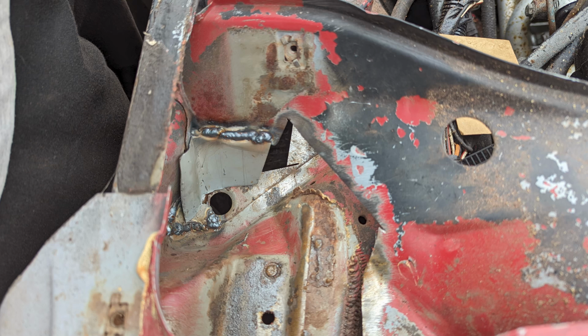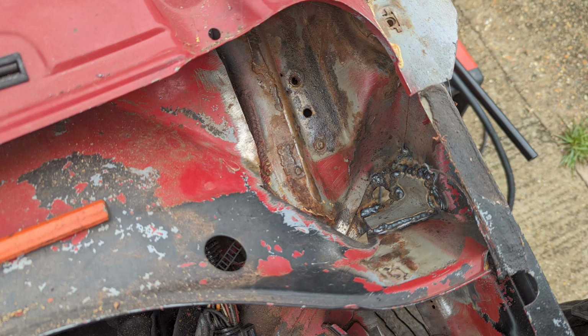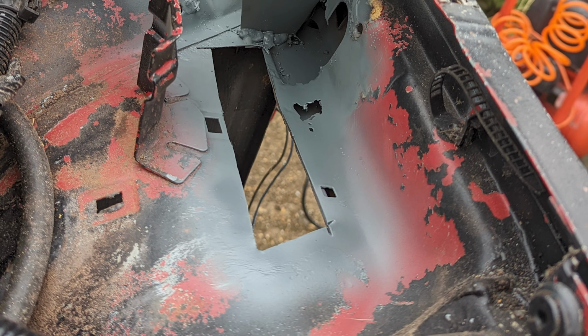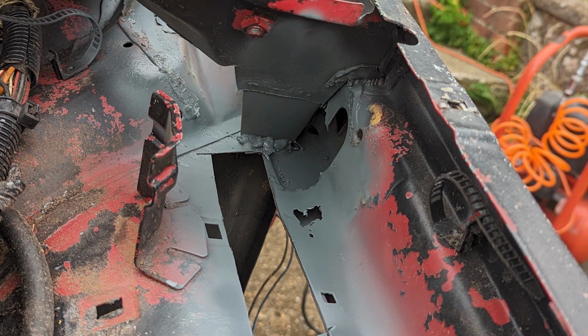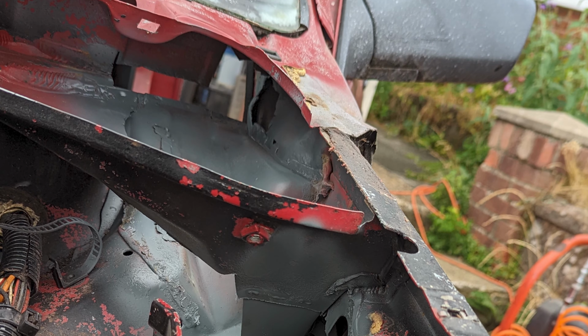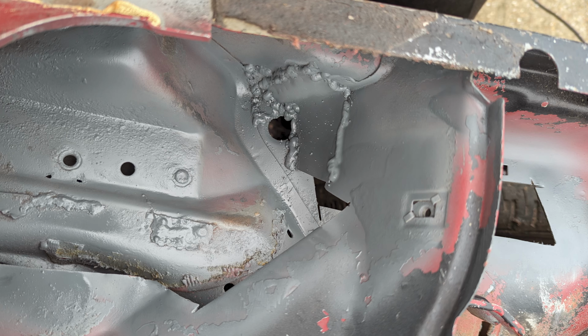So there's the drain hole, and this is me creating the first sheet metal section just to guide that water downhill and onto the wheel. This is it from just a different angle. I'm just trying to create relatively clean, strong seam welds. They're not particularly pretty, but you know, they're strong. They hold water, as I tested, and this is the underside of that first section, and the hole up into the dash. So this is just weld through primer.